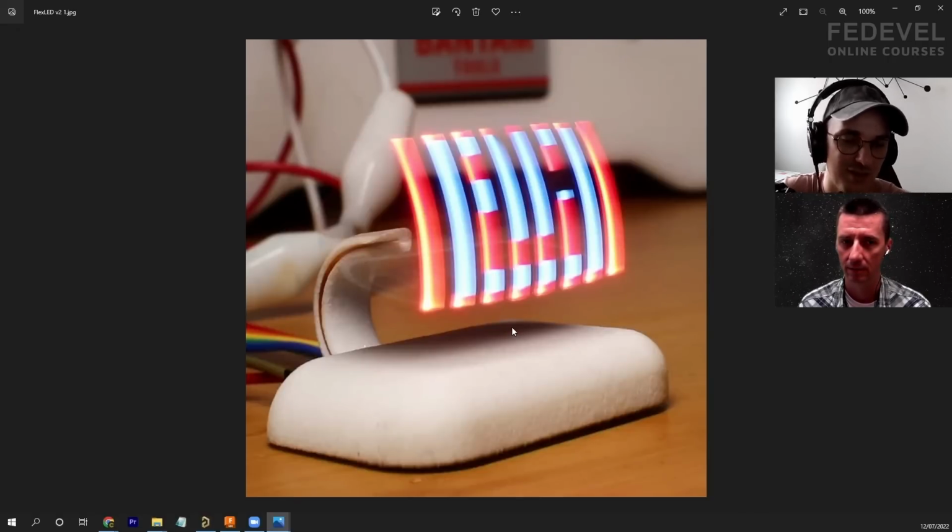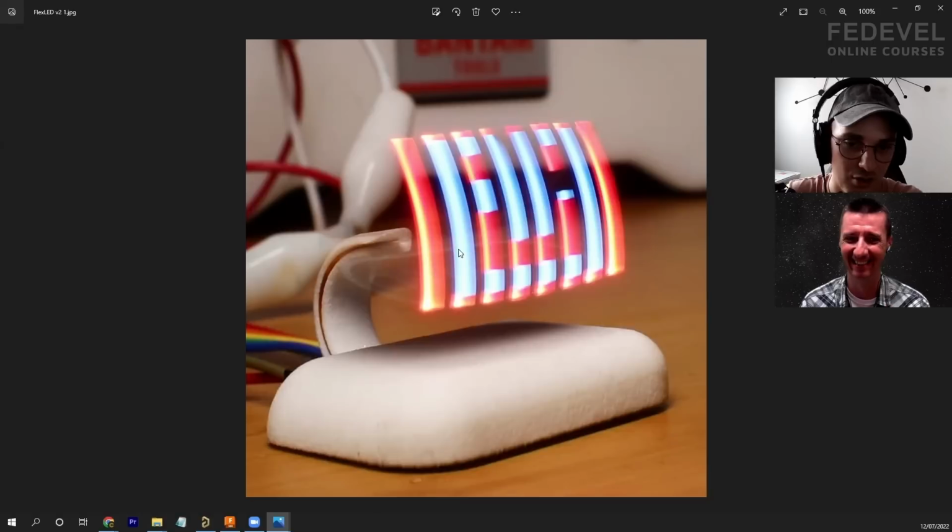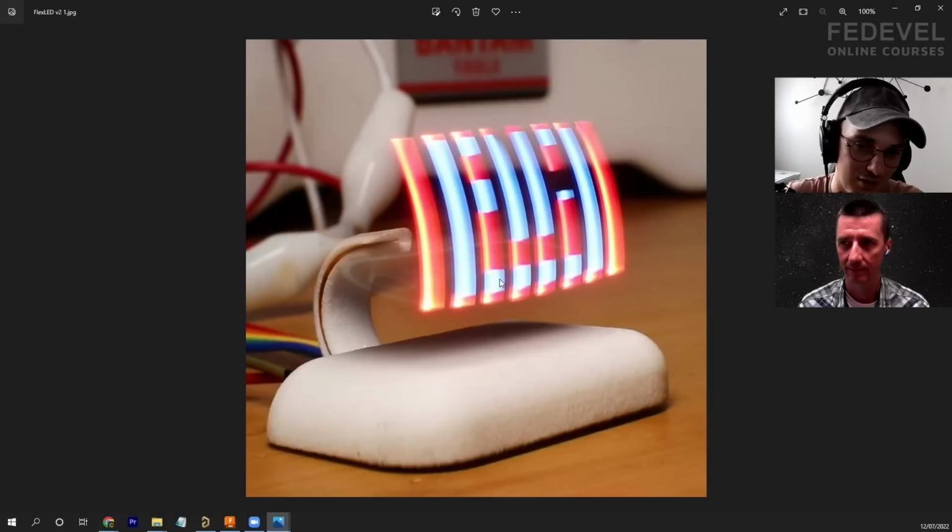Okay, so here the position was being done in open loop. So I just measured the frequency at which it was flapping, and I divided it by 16, the resolution. So I assume that, for example, if it's going to take 0.1 milliseconds for it to go from here to here, I just divided it into... Obviously, then you have another issue because, as you can see, not every pixel is the same size, because it's not the same speed. Not exactly.